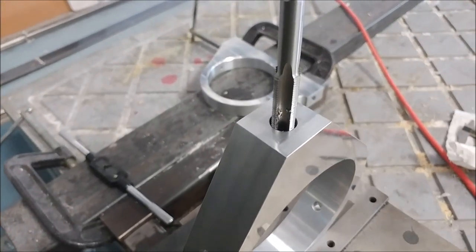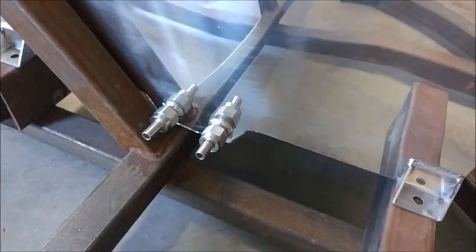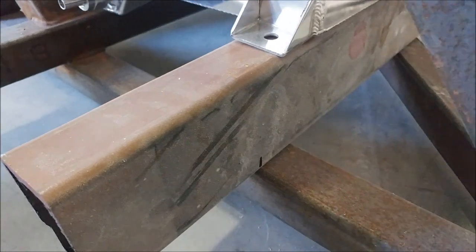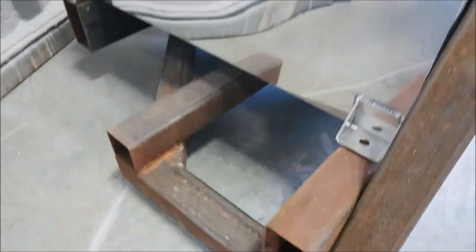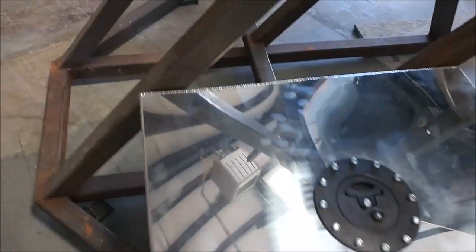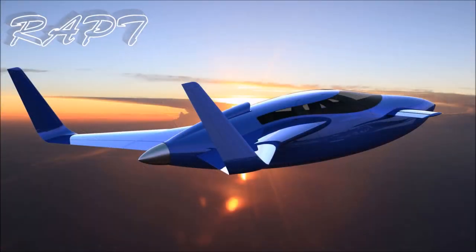These are the brackets that hold the lower part of the belt drive. When they came back from Kyle, we just needed to re-tap those holes a little bit. Our aluminum tank also arrived — this is just for the test stand. I've got a couple bits of two-by-four steel tube rough-fitted to figure out the mounting position, marked where I need to cut them. It's a 20-gallon tank with all the connections we need: feed, return, vent, a level sensor, and a fill hole on top. Tomorrow I'll weld those steel pieces into place and bolt the tank down. The next step will be hooking up the filter and pump. That's our update for the first half of this week — thanks for watching.